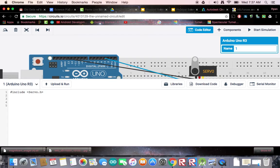The next thing we need to do is make sure that Arduino knows that this thing we're going to be doing is called a servo. This right here is just attaching it to the servo library. Whatever you name it after this is the name of the servo, and for convenience I'm going to call it myServo today. You could call it Bob or whatever you want, but if you mess it up, you might want to call it myServo.